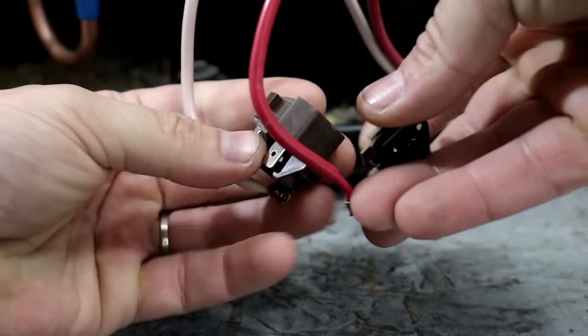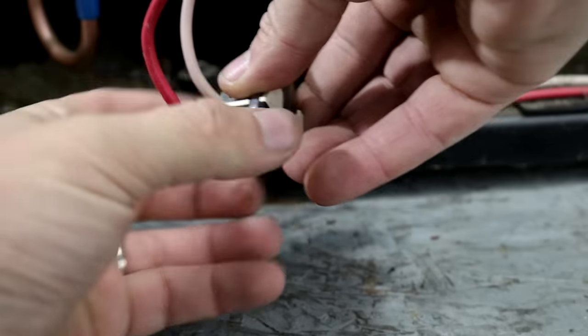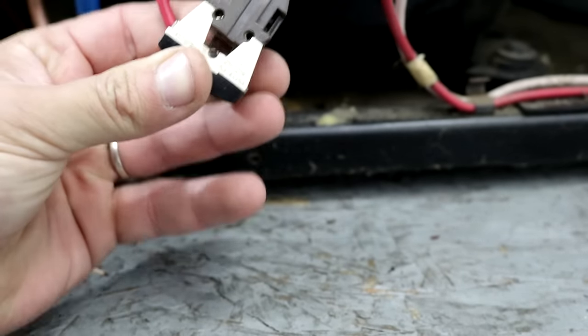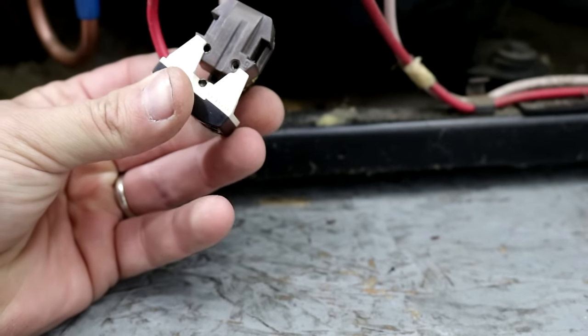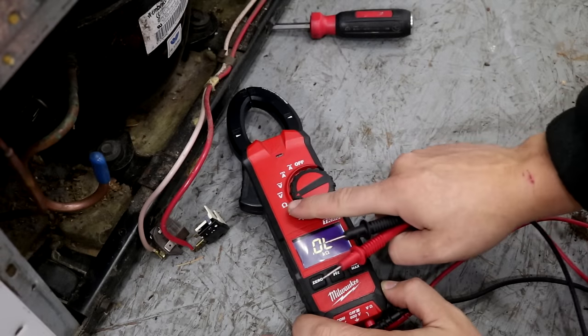And that's basically what makes the compressor run. These two things basically sit together like this, and their pins form a little triangle. And you've got the common on the bottom there on the overload. Then you've got your start and your run winding pins up at top there.